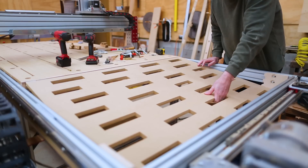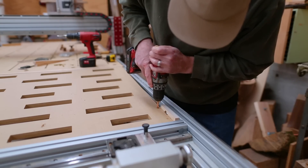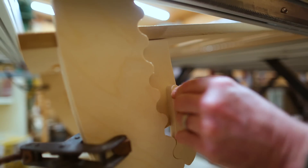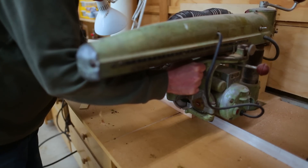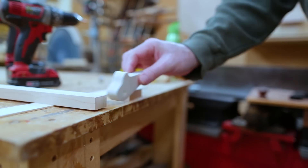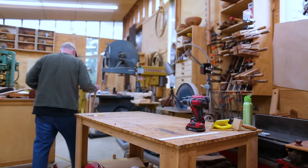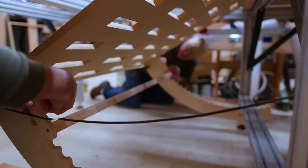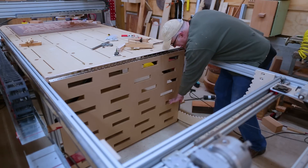Now I can add the little tabs that are going to run along the arcs and hold the little ratcheting mechanism that fits into the teeth on the arcs. I put those on and then realized they really need to be connected, because in order to move the table down I need to be able to lift both sides at the same time. So I put a cross piece between the two — it's actually the piece I cut out of the L-shaped piece that the hinge is attached to. It was the right length and size and works really well, better than I thought.